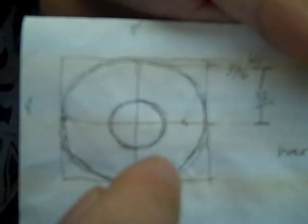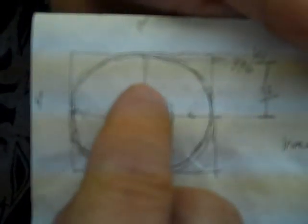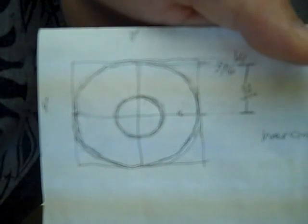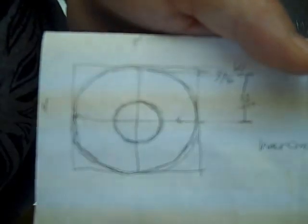I'm going to use a four-foot square because the metal is four feet wide. I'm going to mark a quarter inch around it, and my flanger is 3 sixteenths. So I'm going to put my actual arc — the edge of the duct — at that quarter-inch line, and I'll flange at 3 sixteenths. That way when I cut it off, I won't be cutting out to a flat void in the metal, and I'll end up with a nice circle instead of having a flat spot.